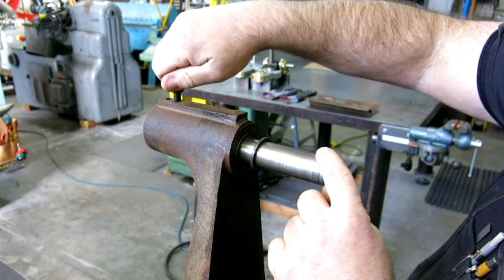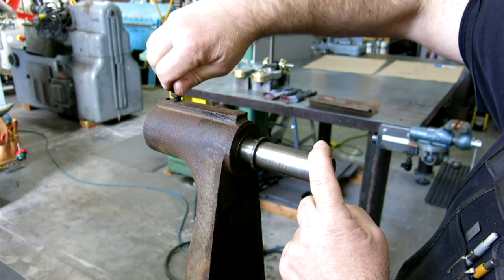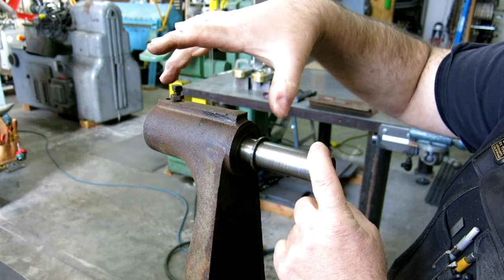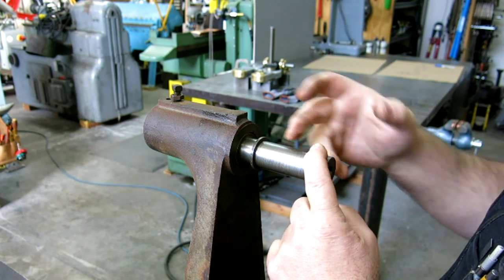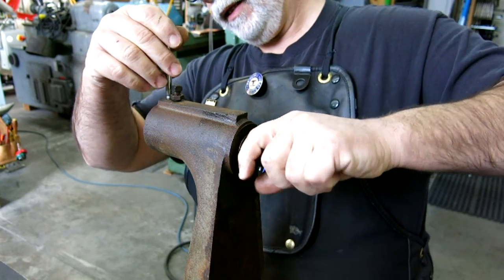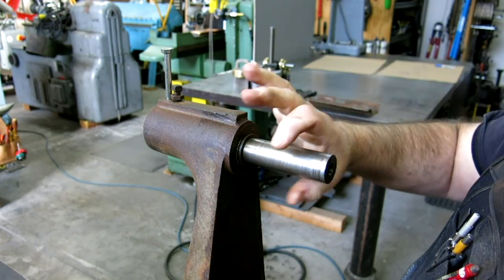Well, this is the screw that allows that to tip. So there's tension on it this way from the blade. And when we screw this in here, it comes down. I should clean that out a little better. See if I can get it. There it goes. See, it's moving. So this allows this to tip, and so we can adjust the tracking of the saw blade. And then there's a pin that fits through this whole mess here that keeps things oriented. Get it in there. All right, there it goes. So that keeps this from rotating in relation to that.